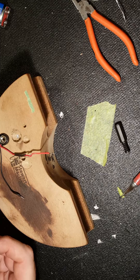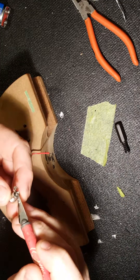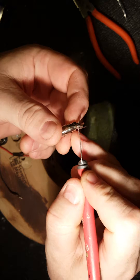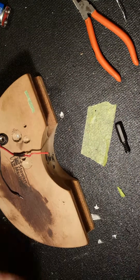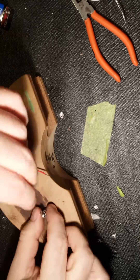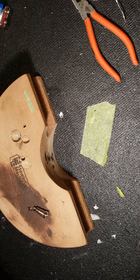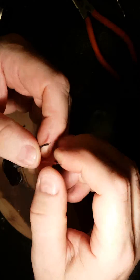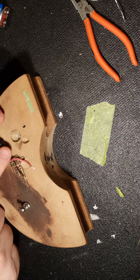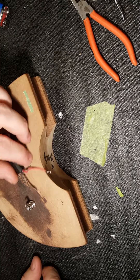So now we know that this is the negative and it's going to attach to that pin. The positive wire will attach to this little piece that sticks out. Before you do any soldering, take this — it's the housing that goes onto there — and fish it over the wires. Because if you don't, there is absolutely no way except taking the whole thing apart to get it on. Believe me, I've done it. Nothing more frustrating than having to take the whole thing apart again because of that.